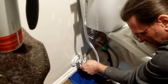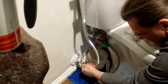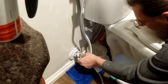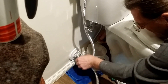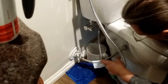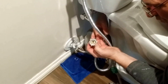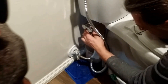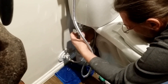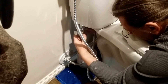These braided lines are fast and good for a homeowner. Look at the water gush out of there. So we will quickly change that. Make sure the hoses aren't going to get tied up. This has a cone-shaped washer inside, so it's already built in. You can just tighten this up. Hold your tee while you tighten this up by hand.